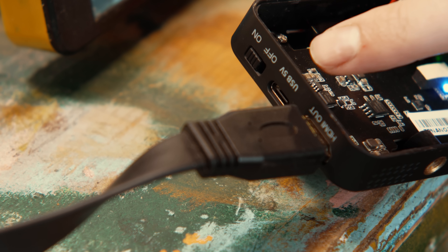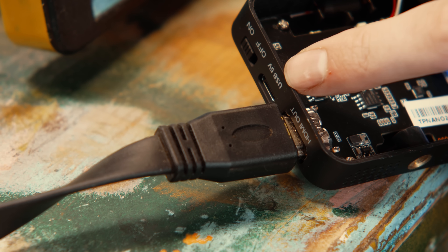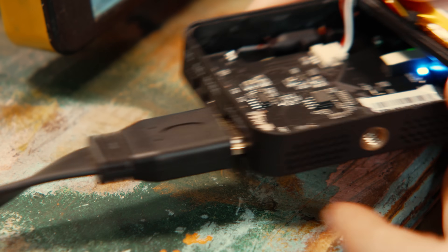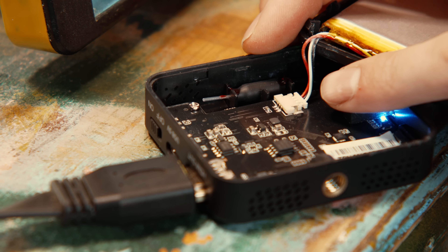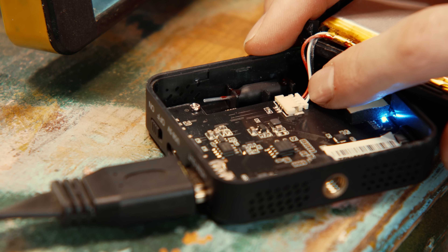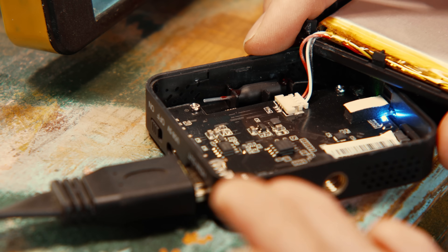This is not sponsored, because I'm not sure they'd be happy with what I'm about to do. Now this one seems to be marketed towards phones — it's got MagSafe on the back and it's powered just by USB-C. They have a larger one that has actual power inputs for rigging, but I value compactness. I see no reason I couldn't just disconnect this battery, tap in wires to here that power it with 5 volts, and it won't know the difference in theory.